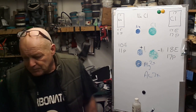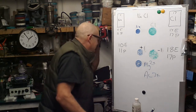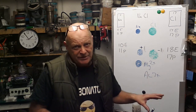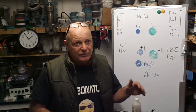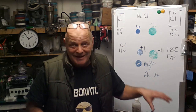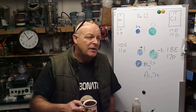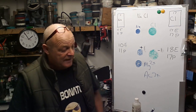So what I'm going to do is look through this video and see if I've made any mistakes. That battery, by the way, a nice curve, almost 14 minutes, so that just proves the point of what I've said earlier on, that because of the amount of material on there, it ain't going to get any better. What I want is 0.05 grams of active material on there, don't I? To make it better, give it a better capacity. I don't think the milliwatt hours are going to go up significantly, but definitely the milliamp hour capacity would go up. So that's that.